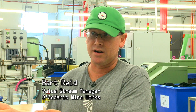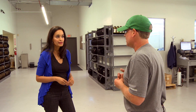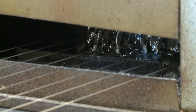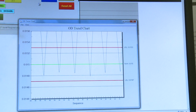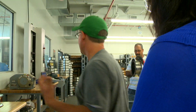The first step is to draw it — we start at a larger diameter and draw it down to the final size and shape that we need. The second step: because we can't make it straight, we have to put it through a two-axis straightener where we take the ring cast out and any side-to-side sweep. After that, it's either finished and ready to be wound on, or has a tin coating put on it. At every step on our drawing machines, we have onboard lasers to monitor diameter — it rotates 360 degrees and traces the shape out, so we know we have a good hex shape, the right size, the right cosmetic.